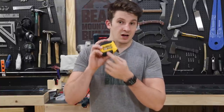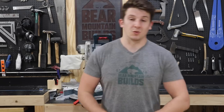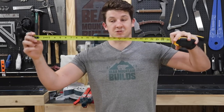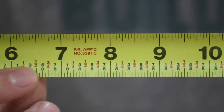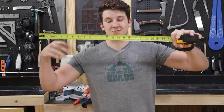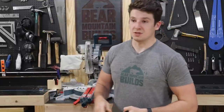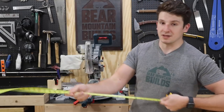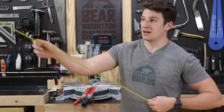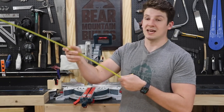First, 20 to 25 feet long — this will be more than enough for whatever you need and not so bulky that you're carrying around a 10-pound weight. You want a wide tape so it's very easy to read. I really like numerical fractions along the hash marks on one side, so you don't have to spend time counting individual little lines. Finally, you want it to be nice and sturdy. When you're extending it out, you don't want it to be floppy — a good test is it should be able to support its own weight at up to 10 feet long.